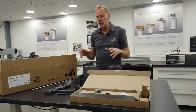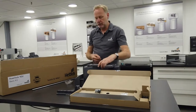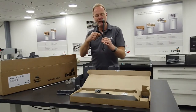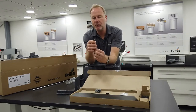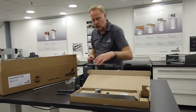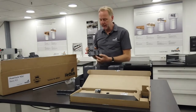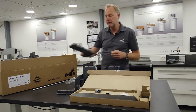You have to pre-drill the pilot holes for the front panels. As you can see, these are very big holes — these are 10 mm holes. To make the pilot holes, there is again a special drill bit in the box. This drill bit is made for these 10 mm holes, and quite easily you can pre-drill the pilot holes with 2.5 mm. The best thing is that you can't drill through the panels, because there is a depth adjustment — you can very precisely pre-drill the holes for the front connectors. If you have the version with sockets, you use a 10 mm drill bit, but please watch the depth. Secondly, you have the option for the overlay of the front panel — up and down or the side overlay — which you can adjust with these parts here. Quite easy to handle, and the manual will be inside the box.